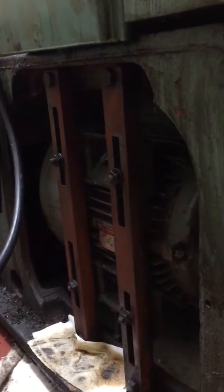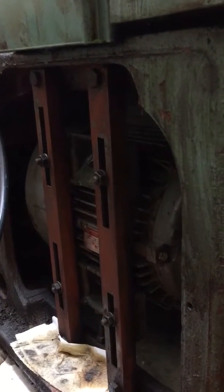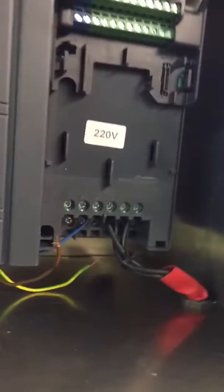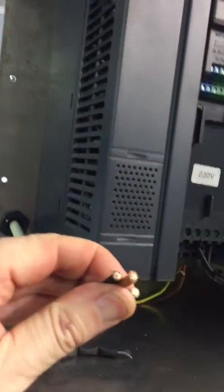The electric motor is down here in the bottom — that's a 5.5 kilowatt, quite a heavy beast. It had the option of 240 volts and 400, so I've changed the internal wiring over to 240. That's now wired through this block all the way up into the bottom of the box, with the big supply wires coming in — 240 volt armoured — looping down the back all the way down the workshop.